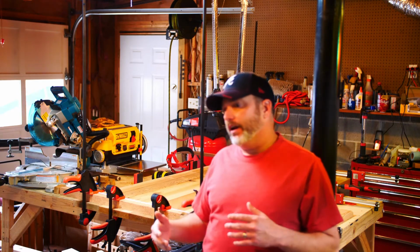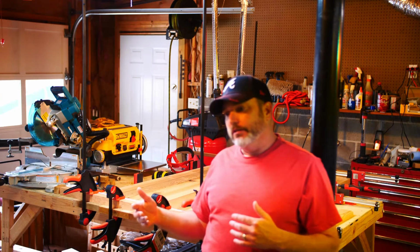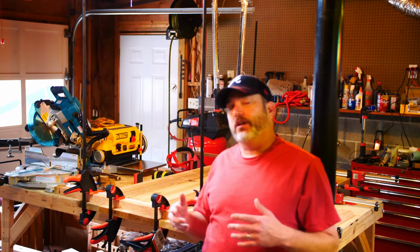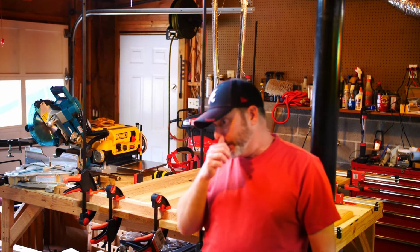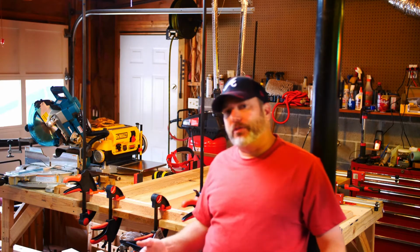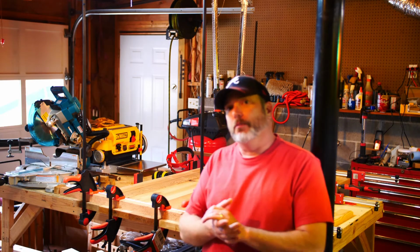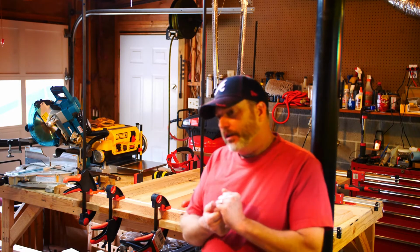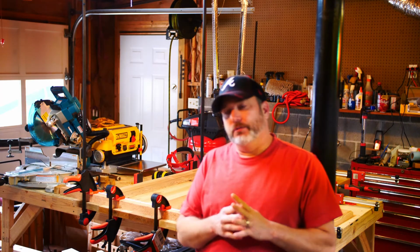I wish I would have gone a little bit slower. I got a little bit of a rush and said, I'm just going to put the whole damn thing together at once. I got past a few boards. I think you could probably slam the whole tabletop together if you had an extra hand, somebody helping you spread glue. And I did probably too many dowels, so it made it a little more difficult, I think, to put them all together by myself.